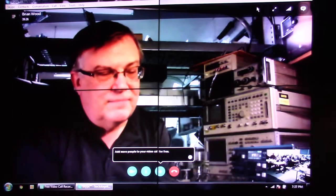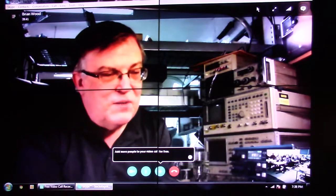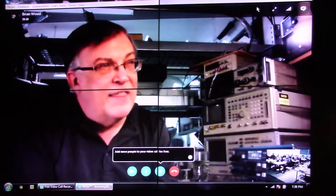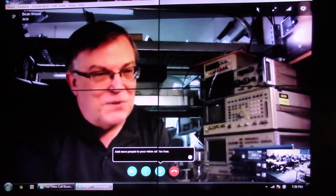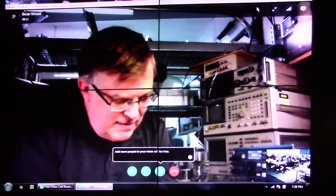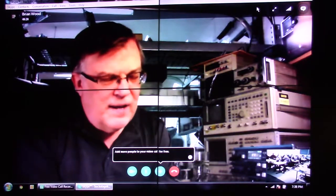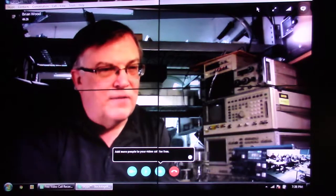Some of the members are interested in computer control. Can you put it on your own computer? Sure you can. Ham Radio Deluxe just removed the Sienna from its list, but it does support it — we've got to get with those guys and make sure they put us back in. Same with DX Lab Suite, that was supported also. It does the SDRiQ external pan adapter — that has built-in support for Sienna. It's the same as the Kenwood and the Elecraft with the addition of new commands that they don't support. So yeah, you can run it remotely from those programs.